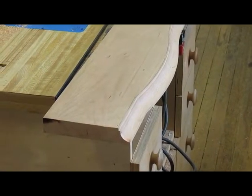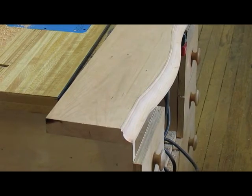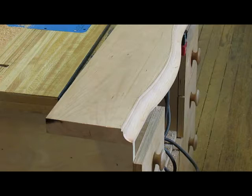I made a pass with the rabbeting bit, and you can see there's a 3/16ths by 1/8th inch rabbet along the top edge. Now all I have to do is cut it out on the bandsaw on the back line and then flush trim it — probably with a spindle sander, since I don't have a template to use the flush trim bit on the back. I'll trim it to the line, but when bandsawing I'll leave a little extra.